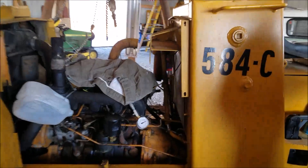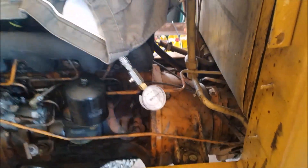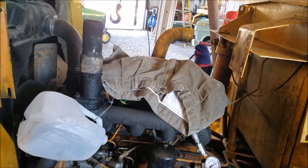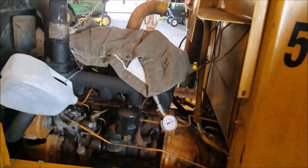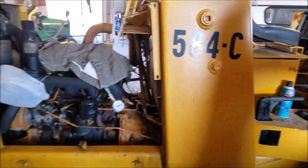That's pretty low - 200 on that one. We shouldn't have to open any throttle; a diesel has wide open throttle all the time. Let's write that down. Might be rings - we might have to put some cylinders in it.